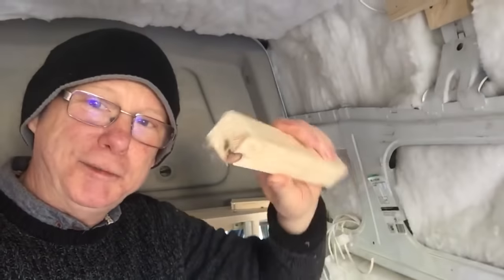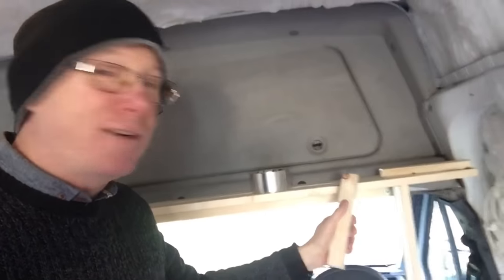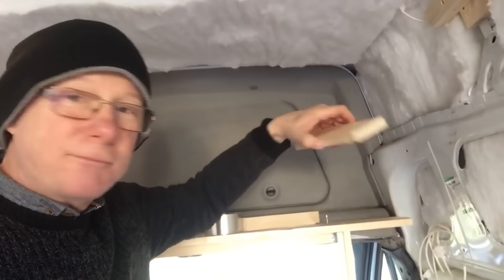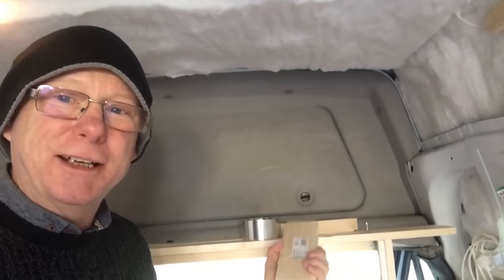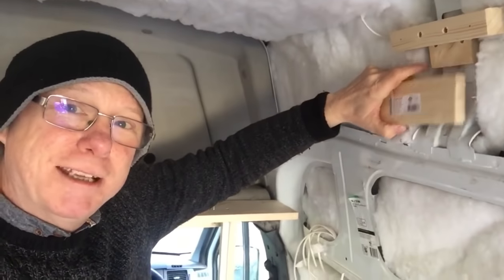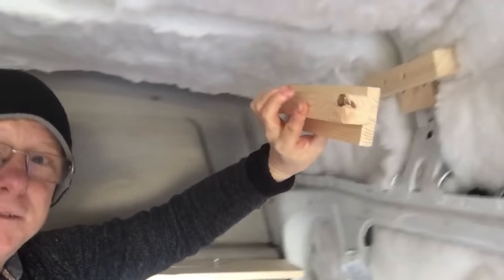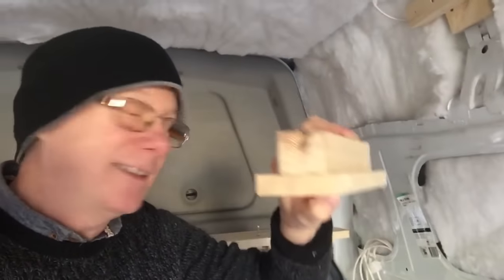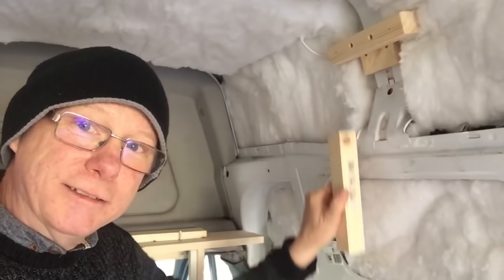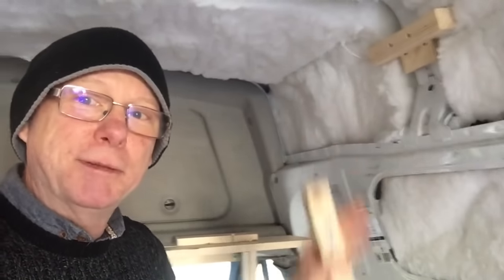To make this step I use this piece of timber, which is 34 by 34 — incidentally the same timber I use for my framework. This I use to step it out away from the headrests, as shown in that video. The framework for this slider is made out of 18 by 70 timber. That goes on first — I screw that there first — and then you end up with a step like this. The thickness of these two pieces of timber together is absolutely perfect for your battens to go down, spot on.